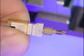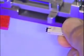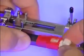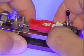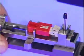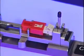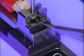The connector will not fit into the tool unless it is in the uncammed position. The ferrule dust cap of the connector should be removed when terminating using the Continuity Test Set. Insert the Unicam MTRJ connector into the wide side of the MTRJ CTS adapter. Pull the winged slide of the Unicam connector assembly tool back and insert the MTRJ CTS adapter and Unicam MTRJ connector into the assembly tool. Slowly allow the winged slide to retract toward the wrench handle and guide the lead-in tube of the connector into the tool. There may be some resistance at this point. Some minor adjustments of the connector body should allow the connector to snap into place. Note, the lead-in tube should rest on the crimp platform as shown when the connector is fully inserted into the tool.